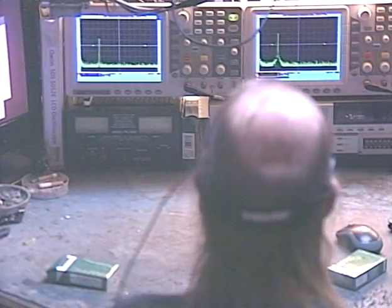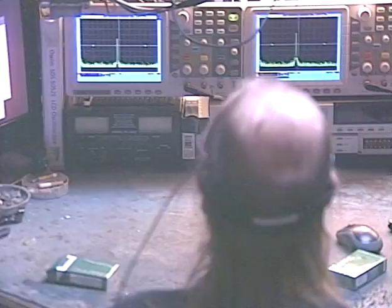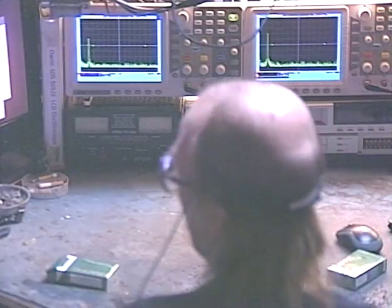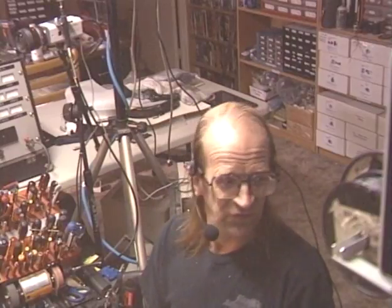But in the real world of 8-track head adjustment, I'm really mainly concerned with the high frequencies, because when I'm making meticulous adjustments to the azimuth, the bass frequencies are not going to change at all. They're going to be pretty much remaining the same. So by having these scopes in my sweep set to a linear sweep, it bunches the low frequencies way off to the left side, and it really expands the high frequencies to about 3/4 of the entire display, making it much easier to distinguish between things like hiss and noise in comparison to the frequency that I'm trying to adjust the azimuth on.